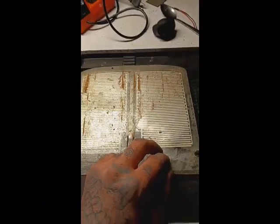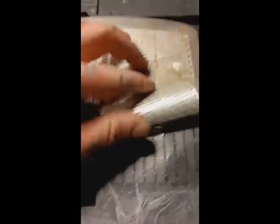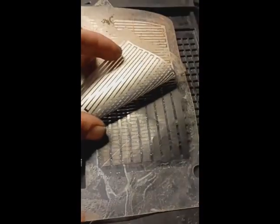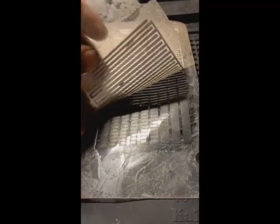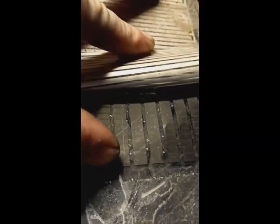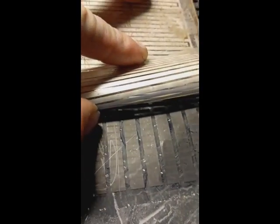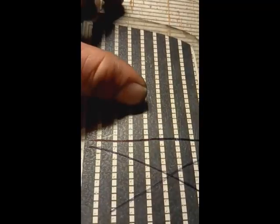And then if you look inside the sensor, you have these two layers that when they make a connection, the signal turns on, and then when you level the board out, your board engages. So it's essentially, when they connect, it's on. When they disconnect, it's off. And these little dots here are the gasket that separates the two layers when you step off. The pint is the same way. You can even see the dots in there.